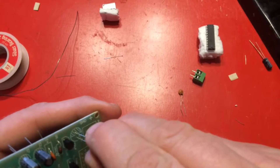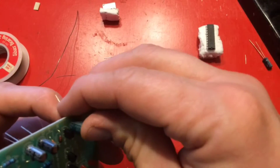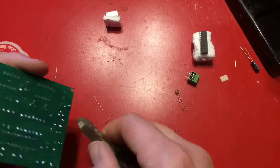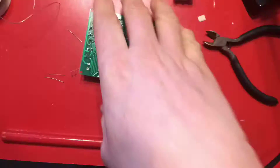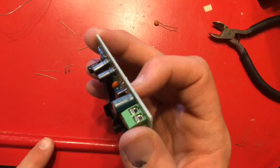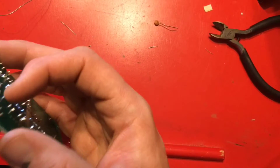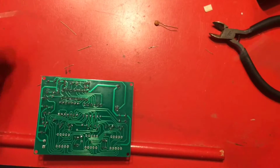These are your electrolytic capacitors, and we'll solder them in. I'm having to rest the component on my little pencil holder because the capacitor is too high to lay flat, so the part keeps falling out. If I rest the component on this bump, then I can solder it.